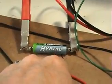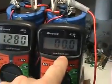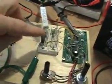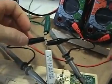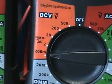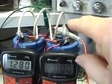The battery is connected and measured at 1.28 volts using my special meter built with a precision resistor to measure voltage and current. I have a 1 ohm resistor in series at the entry, with ground probes at the common negative side. The meter is on the 200 millivolt setting — the most sensitive scale — and right now it is showing zero current being used.